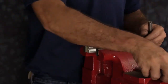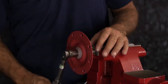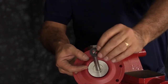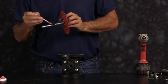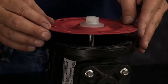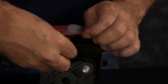Once you have the assemblies together, reinstall your soft jaws and tighten your diaphragm rod into the vise. Thread on one of the assemblies onto the rod and torque the assembly to the rod. Next, we want to install one bumper onto the diaphragm rod and apply a light amount of grease onto the rod. On Santoprene pumps, there is a rubber seal that goes behind the Santoprene diaphragm. You want to line that up to the bolt holes in the intermediate, then install the diaphragm assembly with the rod into the intermediate. Make sure you line up the diaphragm, the seal, and the intermediate bolt holes.